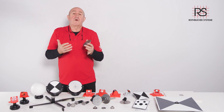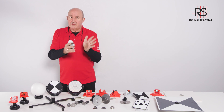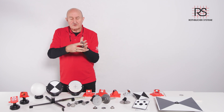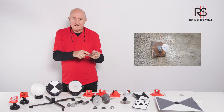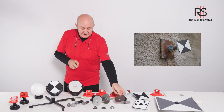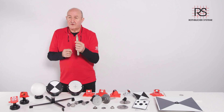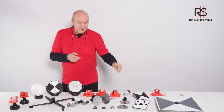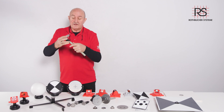For long-term monitoring jobs on steel construction or steel sheet piling, you can weld these items; for shorter terms you can also glue them. This is also stainless steel — all our materials are stainless steel for magnetic use. We also have a special adapter for the Leica bolt, which is important for the tunnel system.